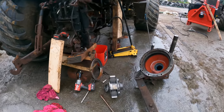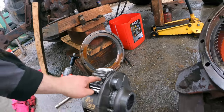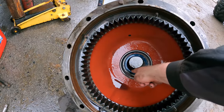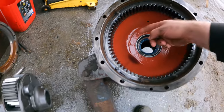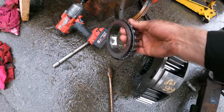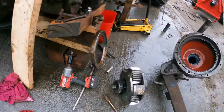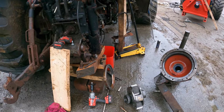So we have it taken apart — that's the planetary gears, all looks fine. That's the seal I was on about — it's that seal that normally goes when the wheel bearing goes and lets all the back end oil out, but that seal is perfect and the bearing on that side is perfect too. Happy days. It's just the other end that needs sorting — getting the shell out of the casting is going to be the hardest bit, so we're getting the welder now.